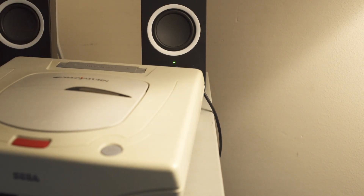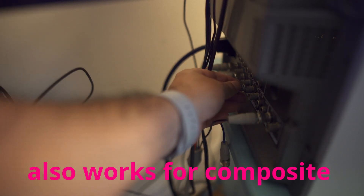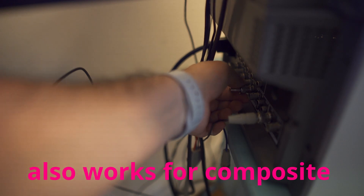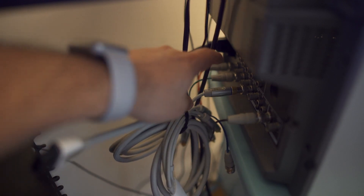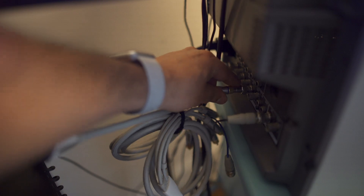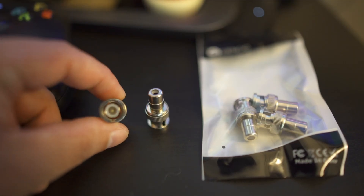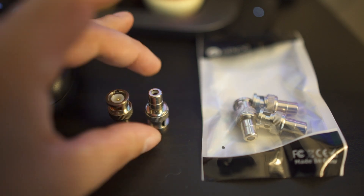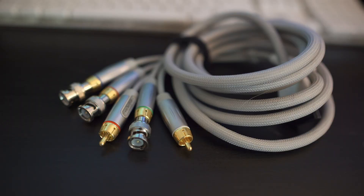It's not a huge setup because I live in a condo and don't have a ton of space. This TV also takes component video and I have these BNC to component adapters — you just pop that in on the BNC lead and then you can hook up something like a component cable from a Wii. You can do that with PlayStation 1, PlayStation 2, Wii, anything that takes a component lead. You can even do VGA with the right adapters. I recommend keeping a set of BNC to RCA adapters around to make it really easy to hook up any retro console into that PVM.